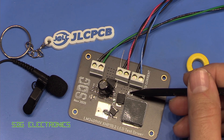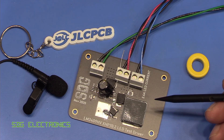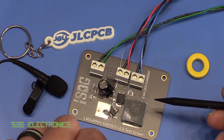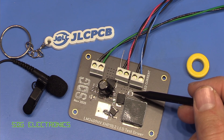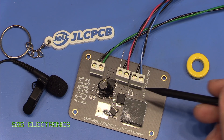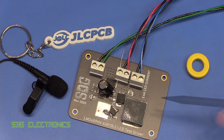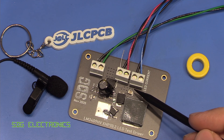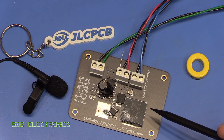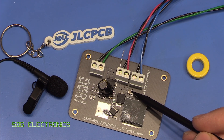We did notice a slight change in tone at the start when I pressed on C3, but the output capacitor C4 seemed to be having more of an impact. So the final question is: was this a bad capacitor, or is it just that those high currents it's seeing are causing quite a bit of noise? We're going to put a new capacitor on there and see if that changes anything. The tone is immediately back. That is a brand new capacitor and it's still making the tone — it's nowhere near as loud, so there will be some differences between capacitors, but the tone is still there.